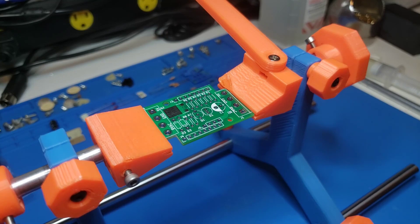What we have here is a circuit board made by someone named bwack. It acts as a middleman between your power supply and your Commodore 64. The older power supplies, being 40 years old or whatever they are, are susceptible to having spikes on the 5 volt rail.